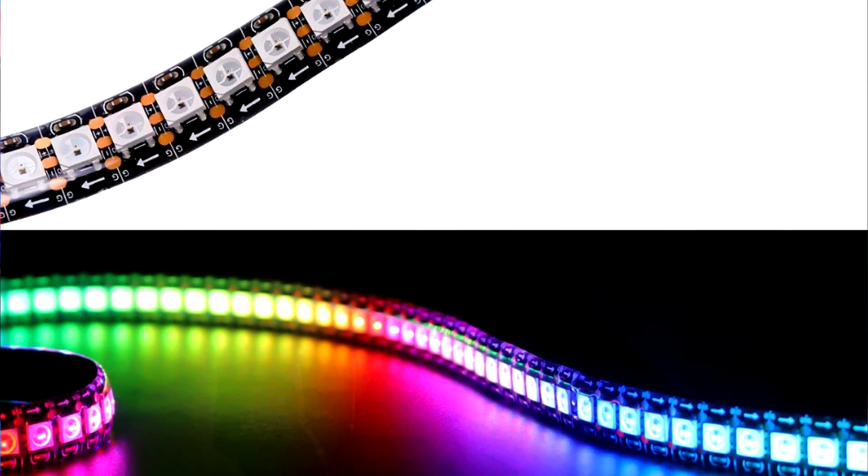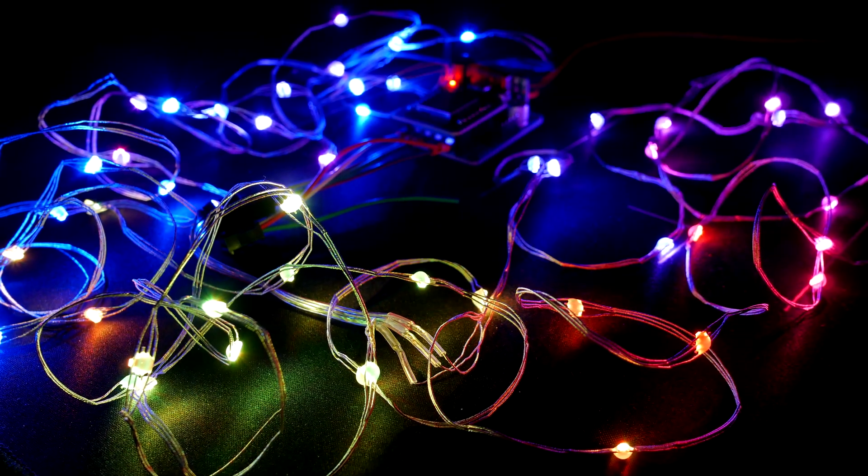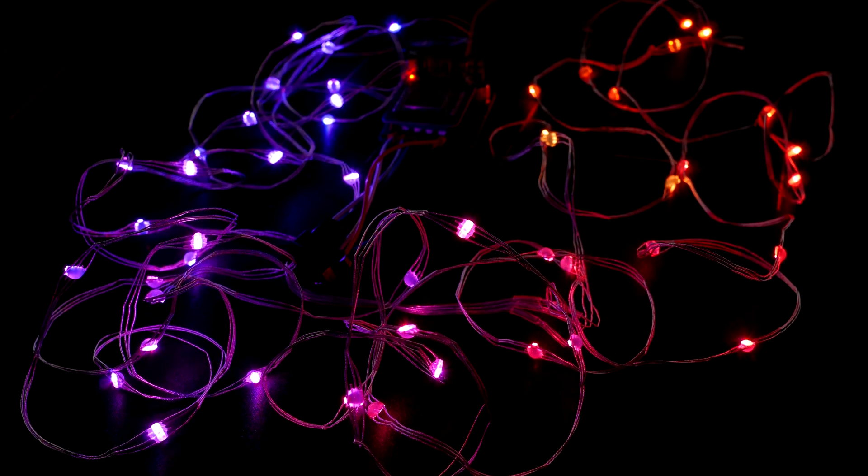Just a little impromptu video today. I ordered these a while back and I've been testing them over the past few days. They're basically a new form of WS2812B LEDs by the same manufacturer. Where the normal ones are often in a 5050 package, these are a 4020 package and meant for side-emitting LED strips — so instead of the LEDs shining upward, they shine to the side.